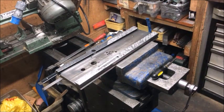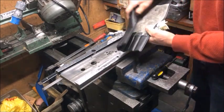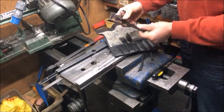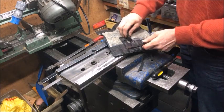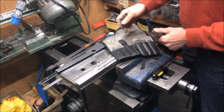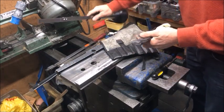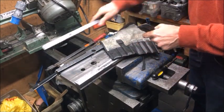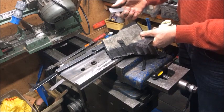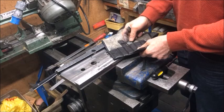Concerning the different scraping blades needed: we have the collection from Biax, with different types — long shank or short shank — and different holders for different purposes. For us amateurs, use the long shanked versions. I know the shorter ones are more commonly available, but the long shanks give much more springy and good action. Consider the shorter stubby blades for experts only — they will fight you a lot more. So leave those for the pros.